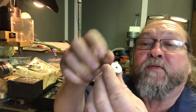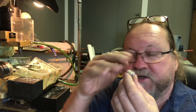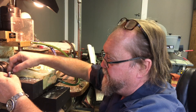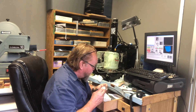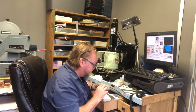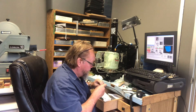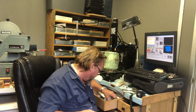I took the bit that was in the machine out. These holders are very important because the tip of the bit, that little flat top piece, sits flat. When I put this on a precise flat surface, I know that's perfect. Over at the other mill I have a drawer of bits - this one is point 0.005, this is 0.007. They're not cheap, they're like $25 each Canadian.